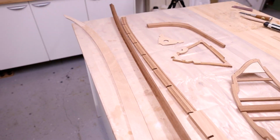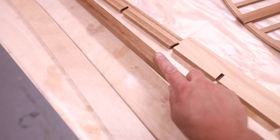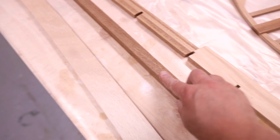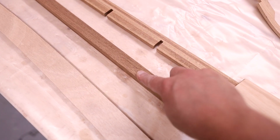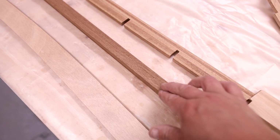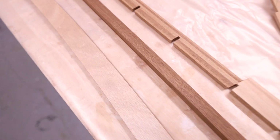Same with the keel as well. We're going to go internal face, and probably just part way up this edge. So we want to just really get most of this, you know, we want to be sealing the keel anywhere that it's going to run through the transition of a frame, so we're not potentially going to be able to seal that too well afterwards.